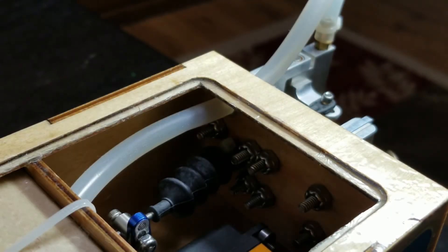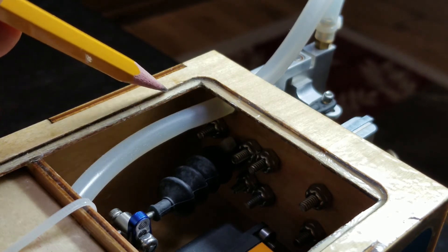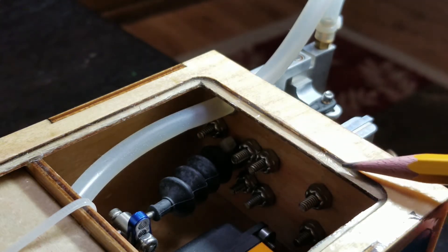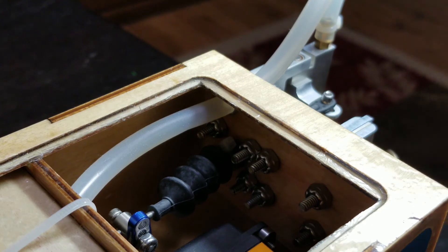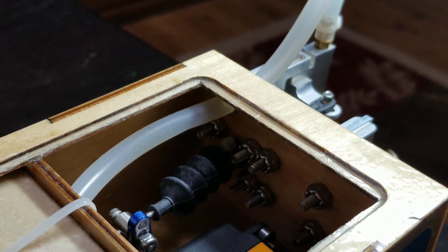Here's a close-up look at my silicone seal. You can see a little bit of extra silicone hanging off in a few places, but it's not hard to do. Run a small bead of silicone right on the lip, then cover that with strips of saran wrap and put the cowling in place, let it cure overnight. Very thin, lightweight, perfectly matches the shape of your cowling. You can even see a bit of wood grain in the silicone right there — but it's simple to do.